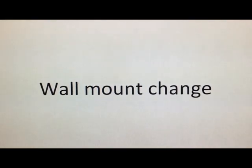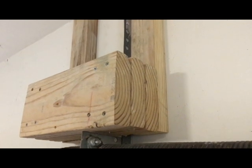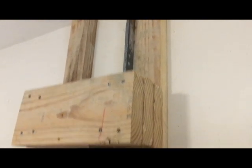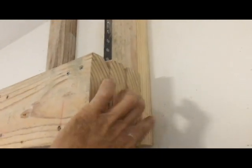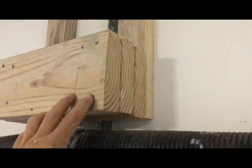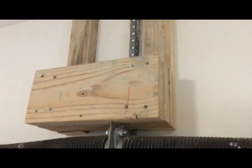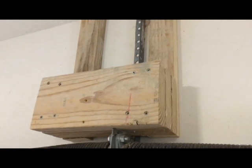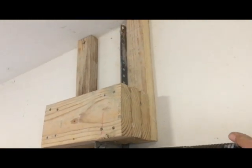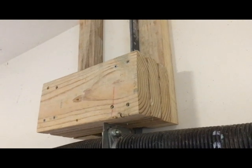I will now show you what I did at the wall. I got those six inches by using two-by lumber — in this case two-by-sixes, each one and a half inches thick, giving me six inches. The vertical pieces were required due to a lack of supporting wood underneath, but I located solid wood and put a very heavy lag bolt into it. Each successive layer was held in place by three-inch drywall screws. That gives me a very stable base to mount the hinge at the end of the rail. You may come up with a different creative solution — I also considered using steel, but opted for this instead.